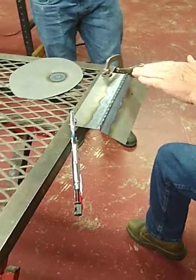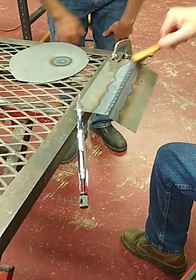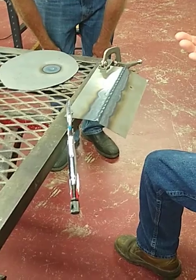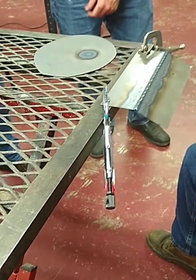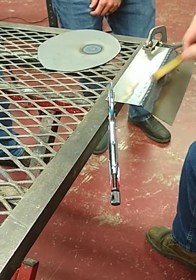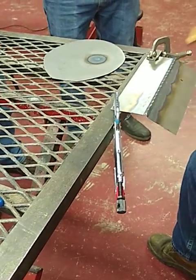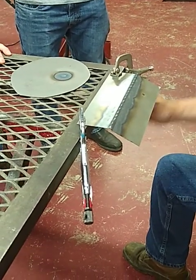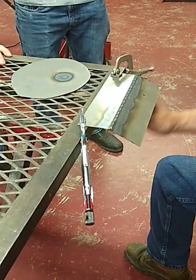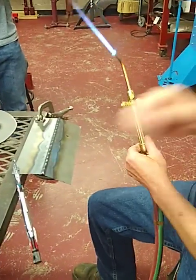For the most part it looks fairly even. The biggest thing people forget to do is remove the oxide. Wire brush the top — see the little flakes on top. That oxide — the material melts at around 1850 to 2000 degrees, but the oxide is elevated probably over 3000. So you have to remove as much oxide as you can; that way the puddle will consistently flow and the speed at which you travel will be consistent. Just let the ambient air cool it off.